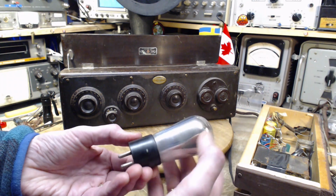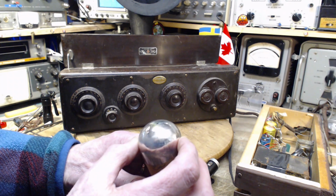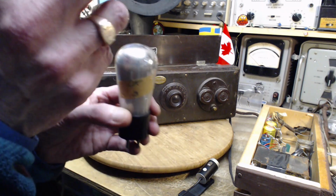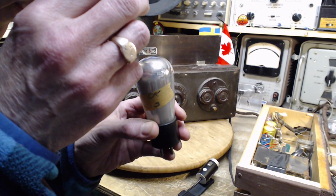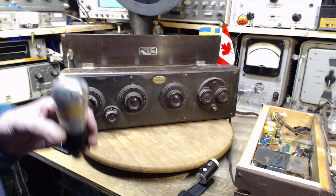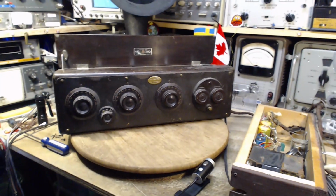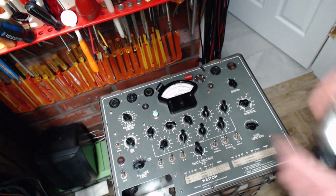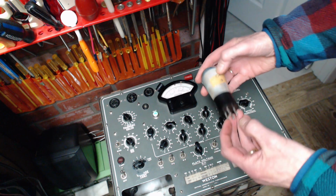And this is a... just want to read it. I think I see it there. And there aren't many tubes from back in this time. The UX201A in a TRF set. They're all just full of these triodes. Later, when you get the more complicated heterodyne, superheterodyne sets, then the tubes became more complicated because you needed the special mixer tube and stuff like that.